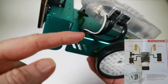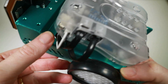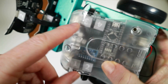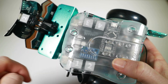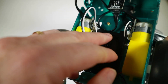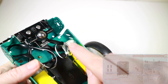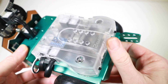Part ten: we're connecting up the control board. A good time before connecting it to double-check the wiring. There are two ports unused — two servo points that don't get used — but the other connections are handily numbered so you can see which bit goes where. Next is to fix this in and make sure the wiring is nicely out of the way. There you go — the control board is screwed down, which is step eleven, and I've just tucked the wire out of the way.